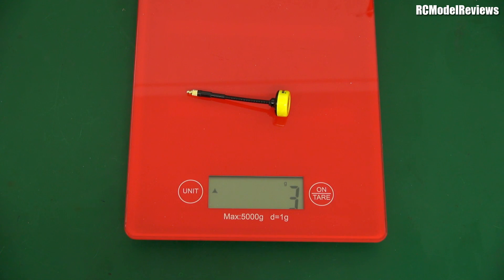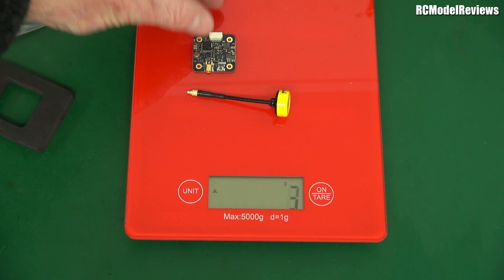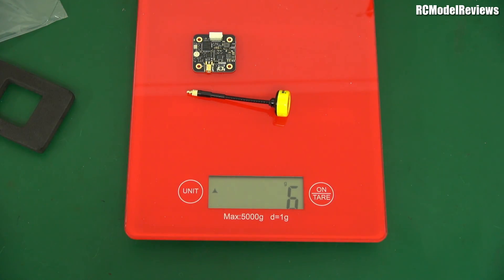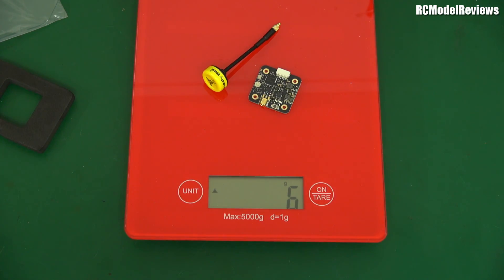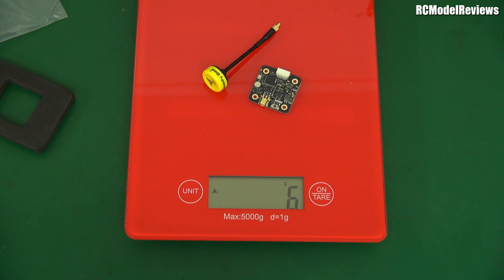Because if you team that with this — they sent me another product here, a little 500 milliwatt adjustable video transmitter from Speedy B. If I put the 500 milliwatt video transmitter and the antenna together, we're still only six grams. This is perfect for sub-250 FPV and longer range too, because we're looking at 500 milliwatts. And with the MMCX connector it just plugs right in. So there we go — that's super lightweight. I was planning to use a more conventional 600 milliwatt video transmitter, but I'm going to go with this in the long-range build. Six grams for your FPV system, and combining that with the little RunCam Nano Racer, we're still looking well under 10 grams for the entire FPV system. That is fantastic.